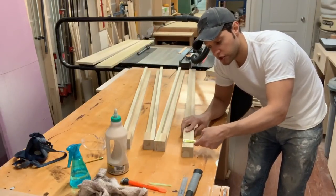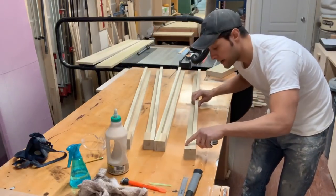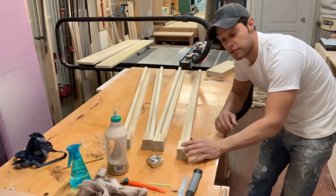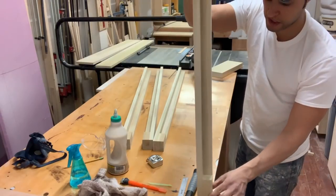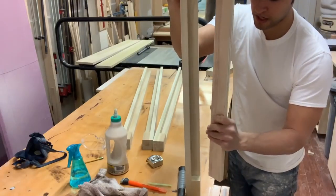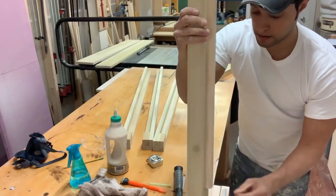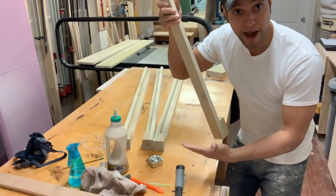So now you have two inches on one side, two inches on the other, and it's even all around. Then on the inside of the leg, after I drew out these gentle curves that are going to be cut on the bandsaw, you saw me cut these little blocks — three inches, one and a quarter wide by one and a quarter wide. When the plywood panels go in to make up the box, those are going to get put inside here, and they also have a cradle and become a recessed panel, so it's going to be a lot easier to put that together and support the bottom as well.